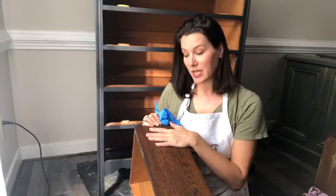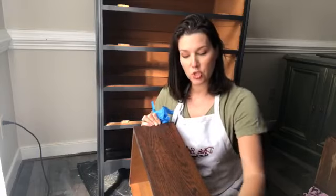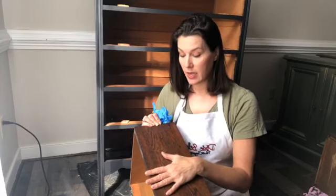After you've cleaned with White Lightning, you're gonna go in and give a light sand, okay, in the direction of the wood grain, just to make sure you're removing any lumps and bumps. If I wanted to, I could go in really heavy in sand. Gel stain can go on a fully sanded surface, totally fine. It will absorb darker, I find, in the color that I like.